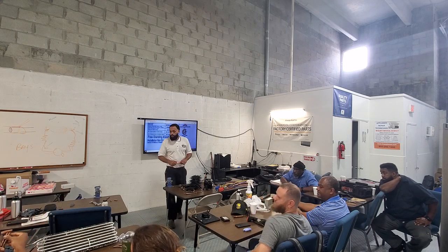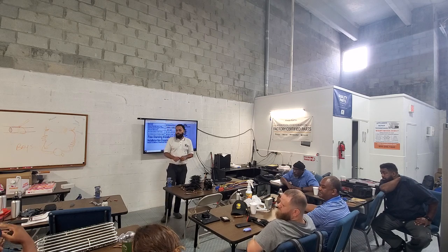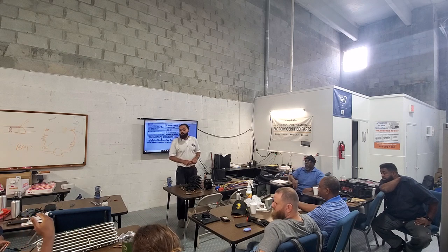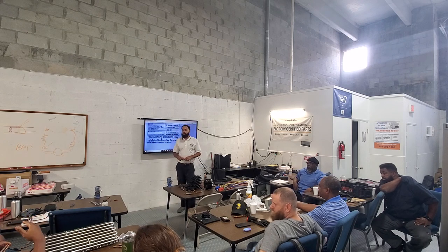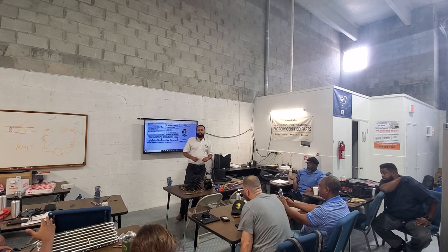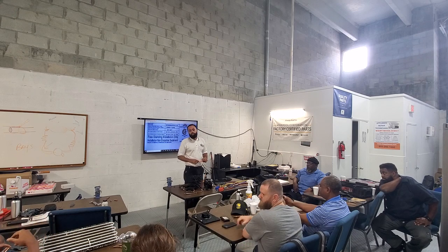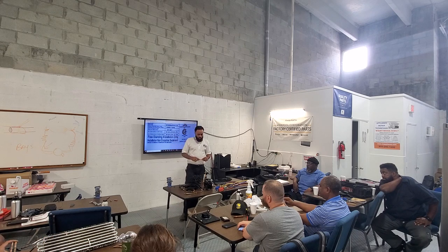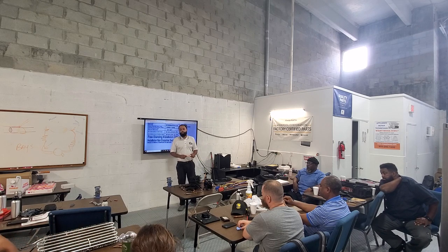If the pressure rises back up, we're supposed to be in a vacuum. We already did a nitrogen leak test and spray loads and everything, and couldn't see anything. But at that point, that's when I would go back and check my gauges, my gaskets, everything. Absolutely, you could have a leak anywhere in all your tools.